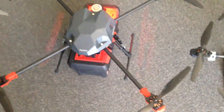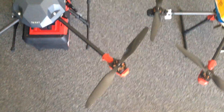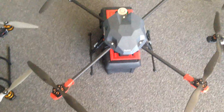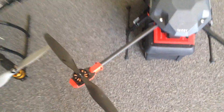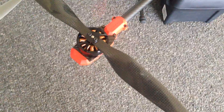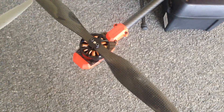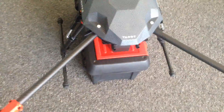The reason I did that is because I wanted to fit 17 inch propellers. At the moment they're just 15, but I've got some 17 inch props on the way. The motors I'm using are Sunny Sky 4110, 340kV. It's designed for 6S batteries, but it flies perfectly fine on a 4S battery too.